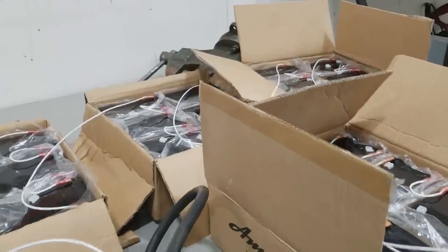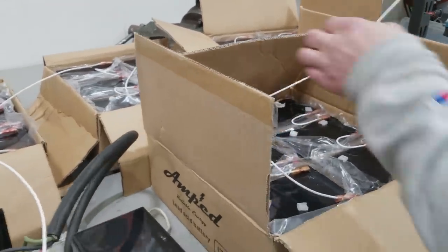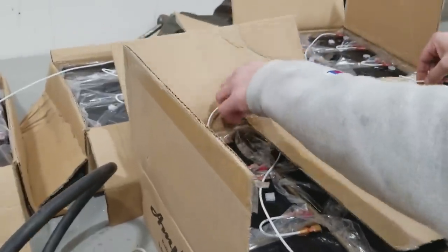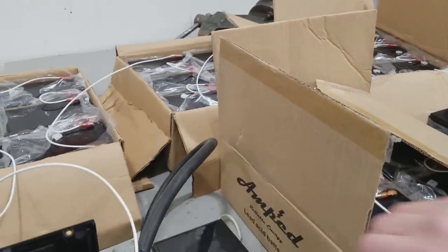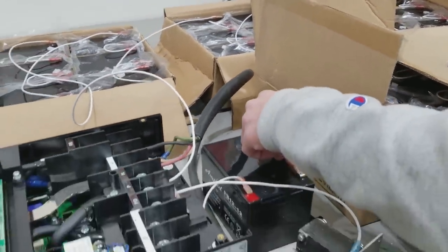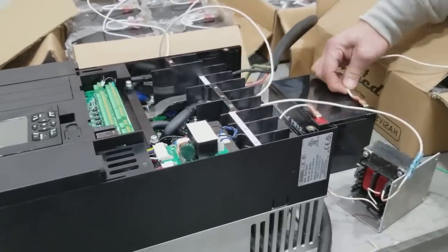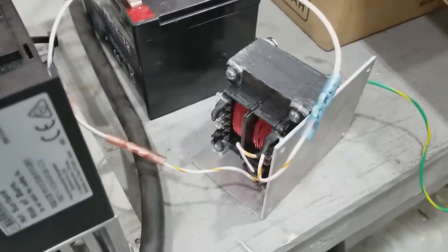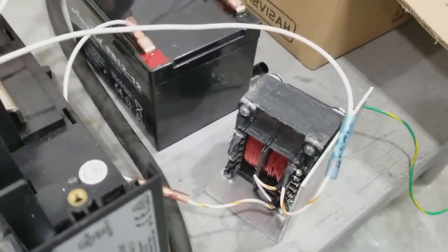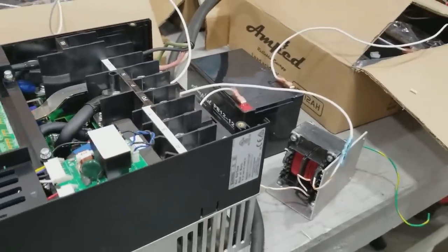You torque it up till you hear the crack, and then back a quarter turn, leave it for the next guy. The story thus far: our intrepid Alec Chicken and his long-suffering biographer have put these lead-acid batteries in series. Plenty of juice in that. How many volts? 300 and some odd. 330 volts DC. Ooh. An ever-increasing sense of doom. And we've got, in series, a choke, which is on the primary side of a current transformer. That's our choke. But we calculated it should only need 3 amps to run this compressor.